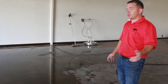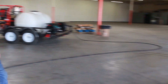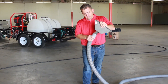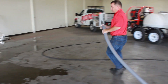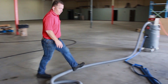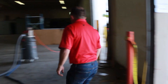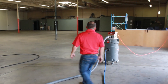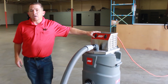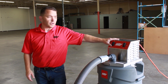So through the RC-30 we're going to walk right through and give you a little demonstration. I want to put my discharge hose in the drain. I'm going to turn on the vacuum and turn on the pump, then I'll walk over to the pressure washer and start flooding the area. You'll see where it's going to start picking up and getting rid of the dirty water.